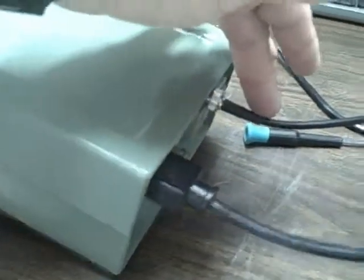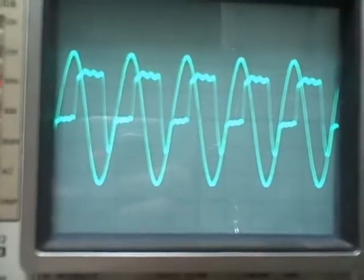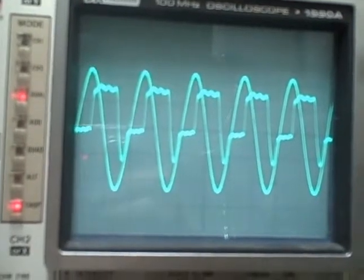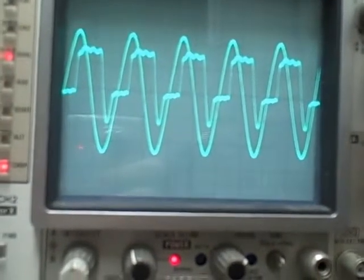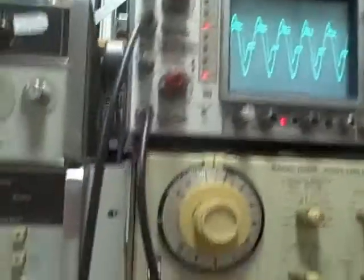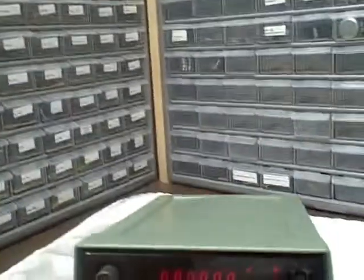What I've done is fed the oscillator output to channel B of my scope, and fed a 10MHz rubidium signal into channel A. We are looking at the sine wave on channel A and the square wave on channel B. I've adjusted the oscillator on the 5302 to match the 10MHz sine wave very, very accurately — better than a tenth of a hertz right now. I don't know that it'll hold that well indefinitely, but at least for now you're going to know that this unit's been calibrated. Let's take the oscillator back into position and feed our 10MHz signal into channel A from the rubidium.